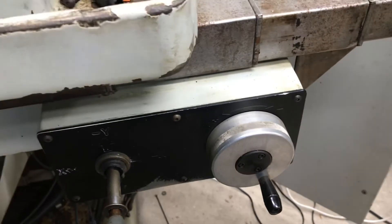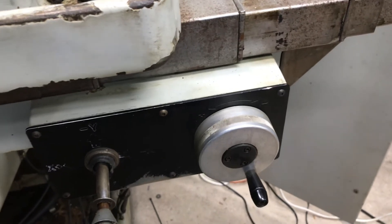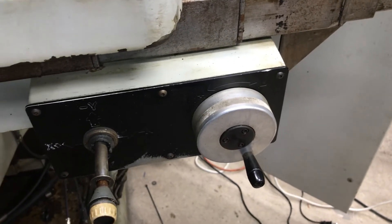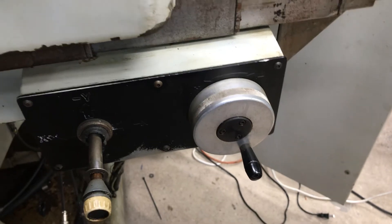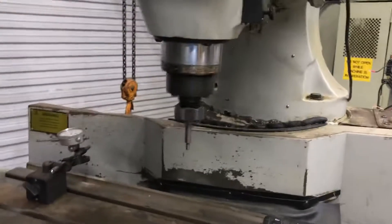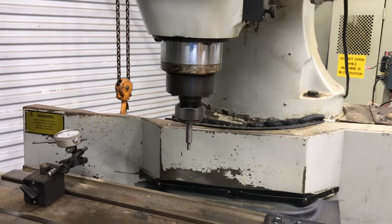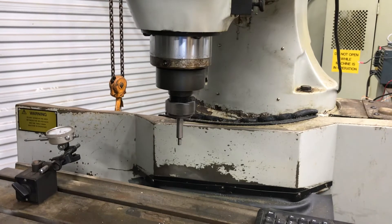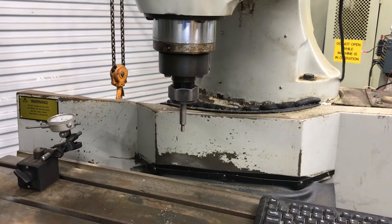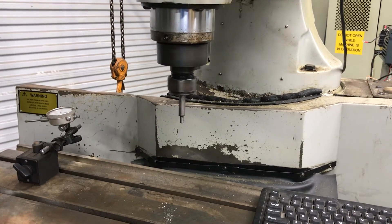I'd really like to put an encoder on the spindle and do rigid tapping. I was surprised that the braking on this machine worked amazingly — all the reviews I've read say they don't work that great, but this one worked amazing. Reverse is working just as well. Change direction — I obviously didn't have to hit start again. When I go from M3 to M4, it seems to go faster. I'll change to forward — watch how fast it is. It seems to change to forward a little bit faster, maybe it's just me.